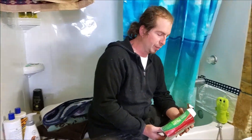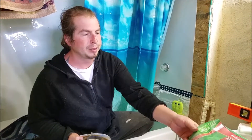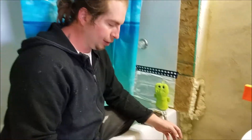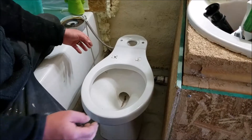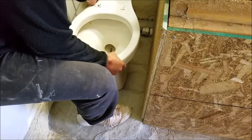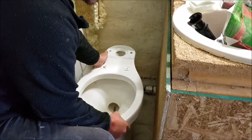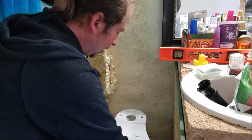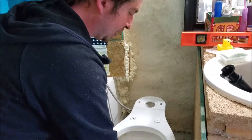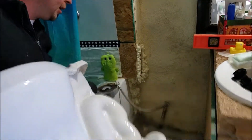Today I'll be installing the toilet base with a wax ring. Right now I'm just testing to see if the new concrete slab I poured is going to balance and hold it. I can tell it's got a little bit of a wobble, but as I tighten the bolts down it'll control which direction it wobbles — it's barely much at all.